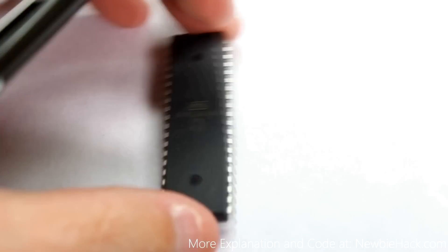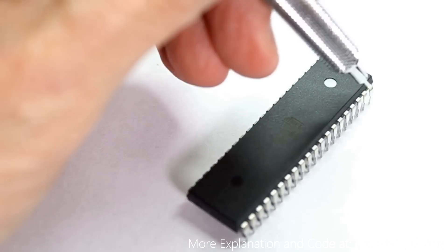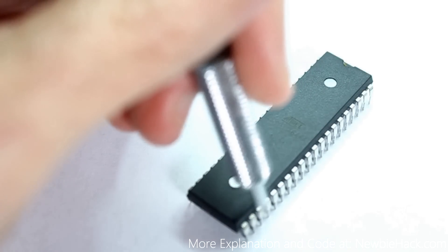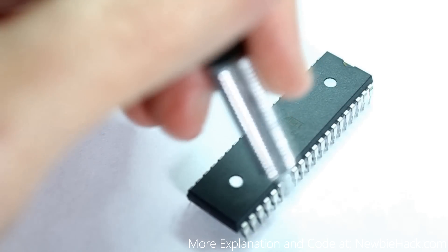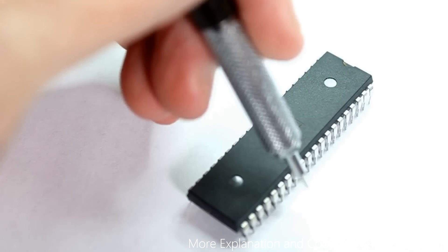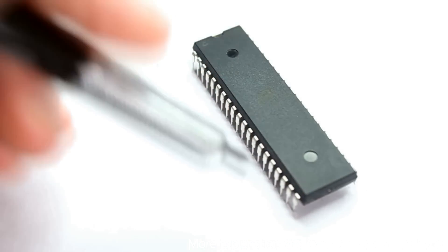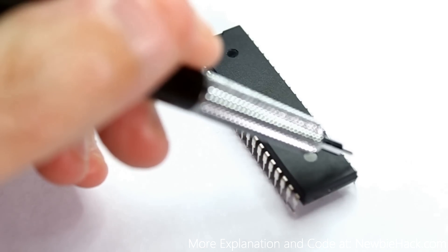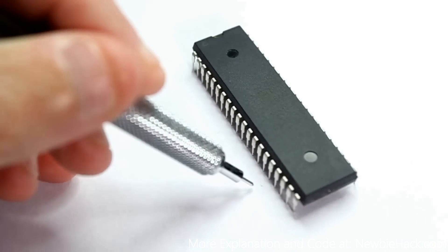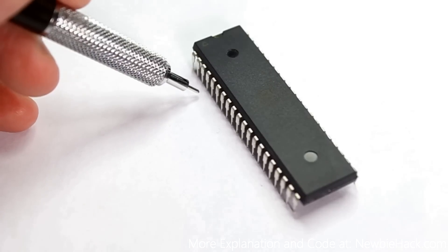I need to plan which microcontroller pins to use. Port A is reserved for ADC devices like accelerometers and gyros. Port C will be used for the LCD so I can monitor servo state — temperature, position, etc. Port D will be reserved for the LCD control pins and the TX/RX line buffer control pins. Port B will hold extra pins, and I may use one of them for a buffer control.